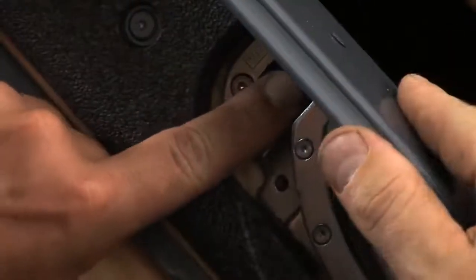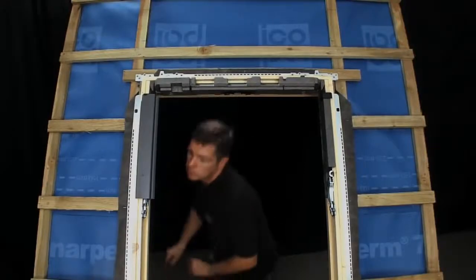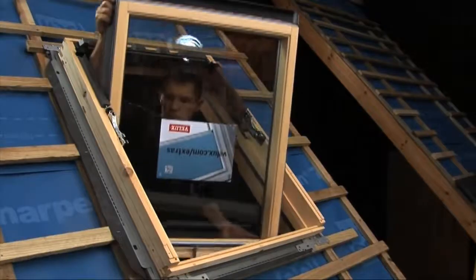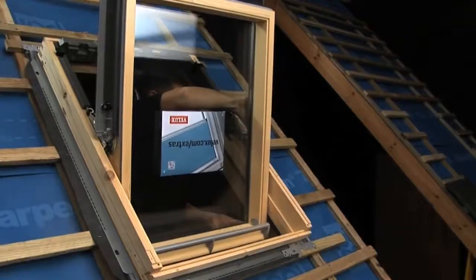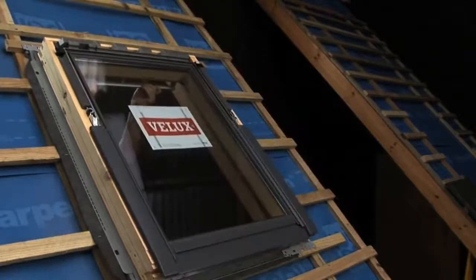The Part 5 flashing parts can be removed at this stage if you find it makes it easier for you to take the sash in and out of the frame. These are unclipped using the plastic fixing on the underside of the cover part. Replace the sash into the frame by lining up the curved hinge pieces of the sash with the corresponding slots on the frame. Carefully look at the space between the sash and frame at the sides of the window.